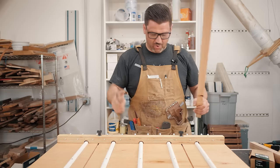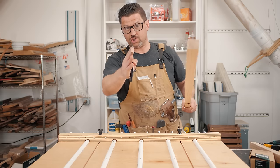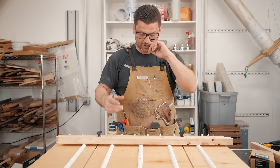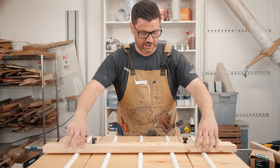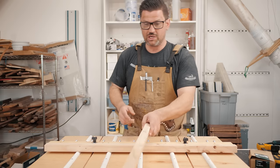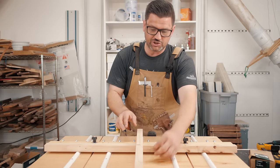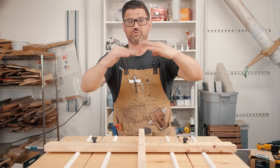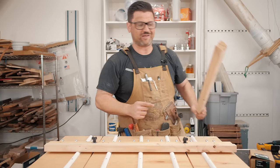All right, so we've got this thing done and boy does it look cool. The way this works is this fence slides — I'm going to show you, we're going to glue up a panel here in a second. You put a caul in between your panel, your cutting board, whatever you're gluing up, then you just tighten down your bolts to get tons of clamping pressure. You can also take a piece that goes across this way, set it over your runners, take little blocks that raise it up slightly, clamp it down, and if you're having problems with your panel bowing up you can use that to keep it flat against the table.